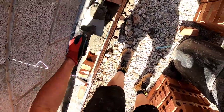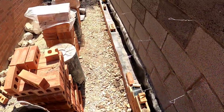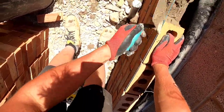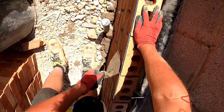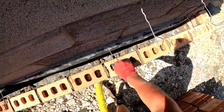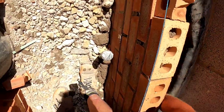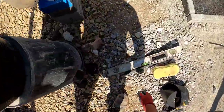That's why I've started going back to blockwork first. It's so much easier mentally to attack a couple of days on the block and then a few days on the brick. It's so much easier mentally to do one side at once — and always the fastest. Blockwork first can cause some problems when it's windy, but knocking out one area at once — I find with brickwork first you penalise yourself because you're walling yourself in. A lot of people don't load out all the blocks before they build the brickwork. If you get all your blocks in first and do all your blockwork first, you're knocking out a massive shell of your house first, you can get loaded up, set up easier, and then the brick can be an afterthought.